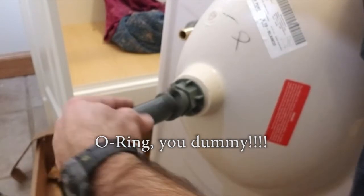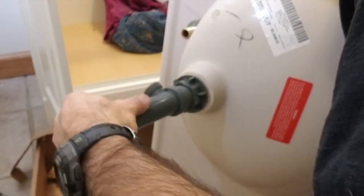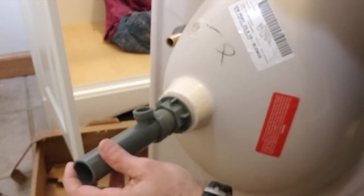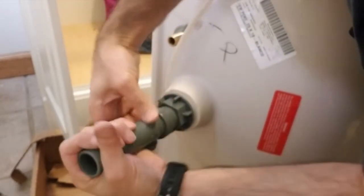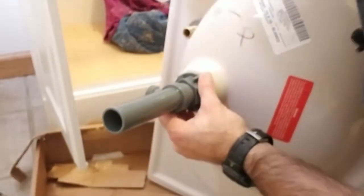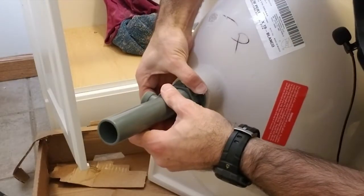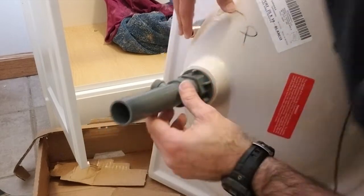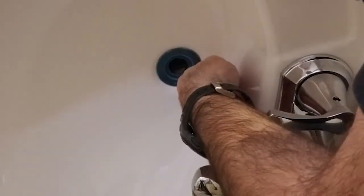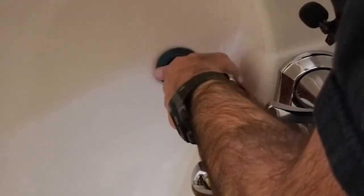I found this process to be a bit of a pain. That gasket's pretty tight — a combination of pressure and twisting helped it move. Leave a comment below if you have any tips on making this easier. If your sink has an overflow port, be sure the openings in the flange align with the port. I noticed the O-ring had popped out, so I made sure to reseat that before tightening. Make sure this faces the back and lines up with the hole. Tighten it down, but not too tight — you don't want to crack the sink. I wiped away the excess putty that squeezed out.